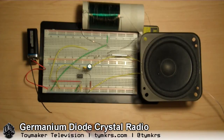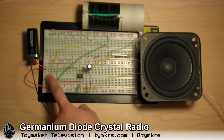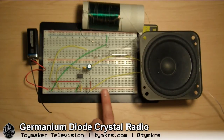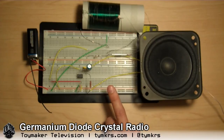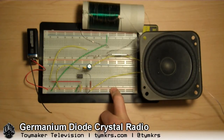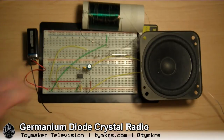Yeah, it's super simple. And normally these two would go to the 1/4-inch jack, but since I have an LM386 audio amplifier with a speaker, Whisker suggested that I just hook it up to my audio amp and run it through that way. You've literally built yourself a radio here. You get your receiving end of things, and you get your amplification end of things. So you're not using any existing equipment to do this. Correct. From scratch, really.